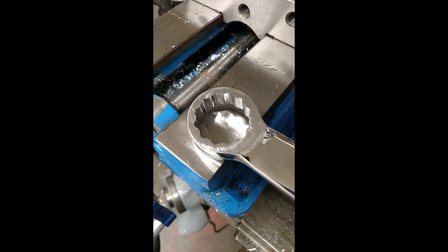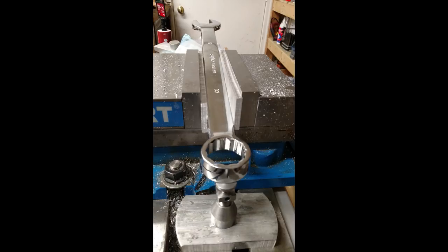As far as a milling operation goes, it's pretty straightforward — the steel's not too bad to machine — but it's a little awkward to hold because it's a forging and the sides of that wrench aren't perfectly straight. Since the edges aren't perfectly straight, it will want to pivot on any high spots between the vise jaw and the wrench. To get around that, I've put a small piece of aluminum on either side of the wrench. This allows it to crush a little bit and the aluminum deforms around the wrench slightly, making for a much stronger hold.